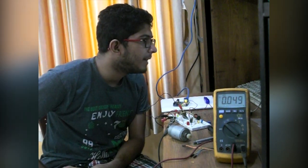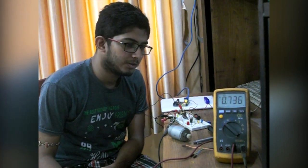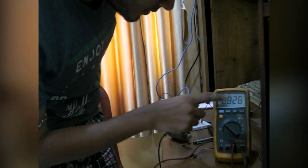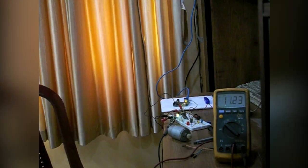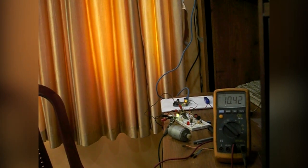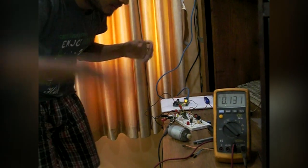The compiler is happy, no errors, it's uploaded. But it's still showing 9 volts - and then my capacitor popped! See what happened - my capacitor exploded, maybe I was just getting more voltage than it was rated for.